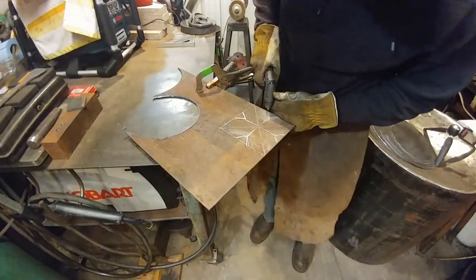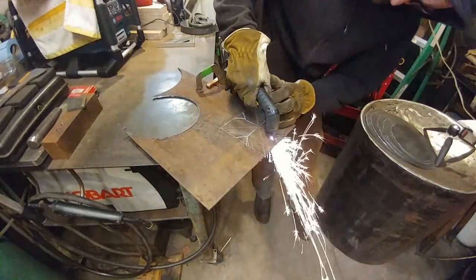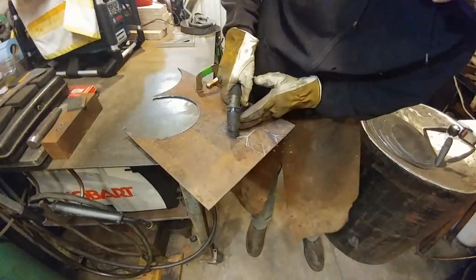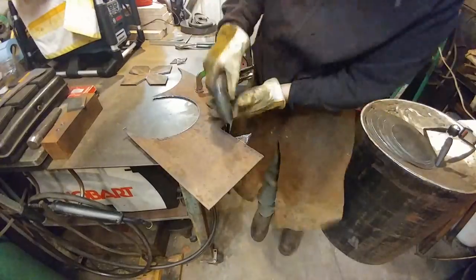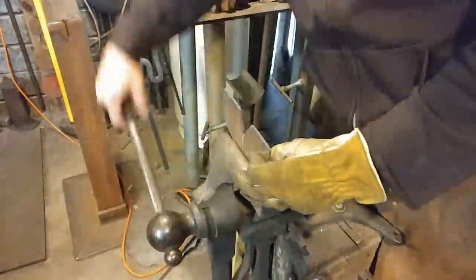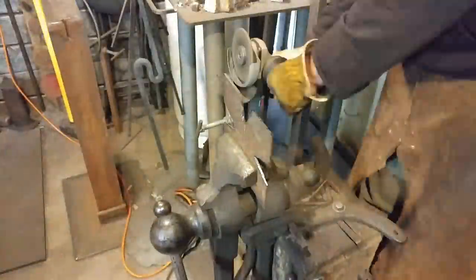Going to go ahead and cut up this petal now. You guys can easily do this with an angle grinder, bandsaw, or whatever you have available. An angle grinder with a cutoff wheel works just fine for cutting out these blanks. I just happen to have a plasma cutter, which really helps on the efficiency side of things. After it's plasma cut it'll leave some little slag pieces that you've got to beat off because those are pretty high carbon. Then we'll just clean up the cut lines and get this material prepped up and ready.